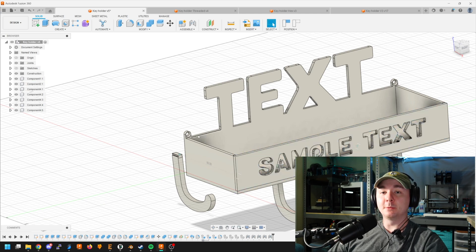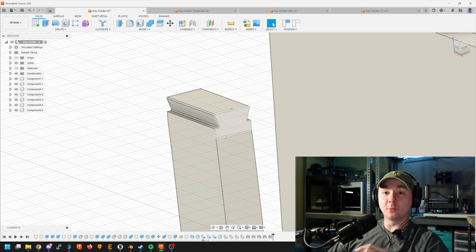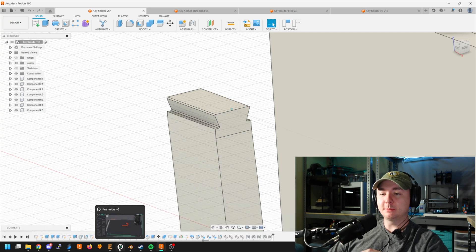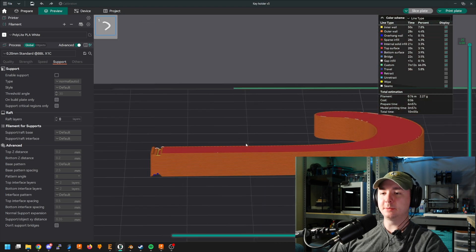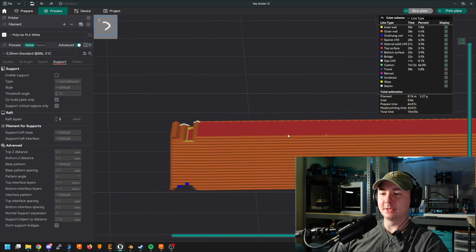The problem here is when I thought about using glue, I thought, well, let me not have people use glue, and if these are glued in, then you can't really replace them anyway. The other problem with these dovetails is they're really small. So if you put them in the slicer and you print them in this orientation, which is best for strength, you kind of don't get the level of detail you need to actually print this.